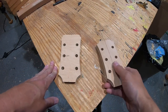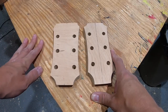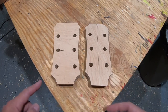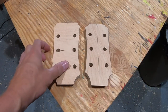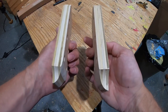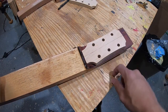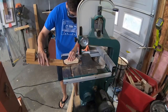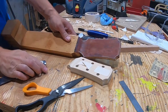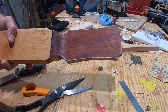Taking a little break from the soundboard before sanding, so I figured I might as well start on the headstock — at least get the shape cut out and the holes drilled. This is the previous guitar's headstock shape and this is the one for this guitar. I basically thinned up the top a little bit and brought this point higher than on the last one — I thought the old one looked a bit too chunky. I've cut the shape into a piece, double-stick-taped it onto the neck blank, and I'll cut it out and shape up to the line with the spindle sander, then drill out where the holes will go.